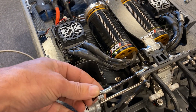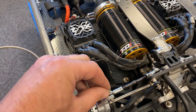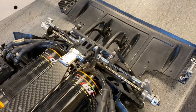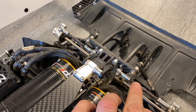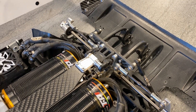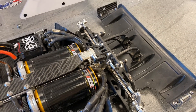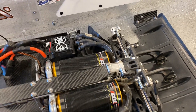The turnbuckles are kind of handmade specials using Dunlop engineering grade rod ends. They're a bit of a pain to make, to be honest, but maybe other people can replicate them. They're actually M3 ones that you drill out to M4 and re-tap, so they're kind of a nuisance to make, which is why I don't actually sell them. They're really nice rod ends — engineering grade quality.